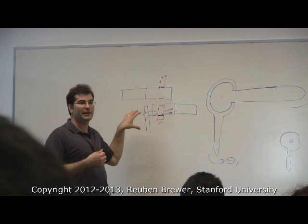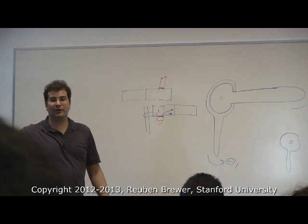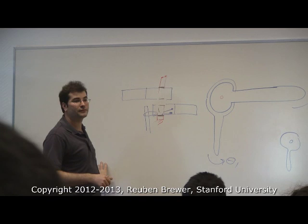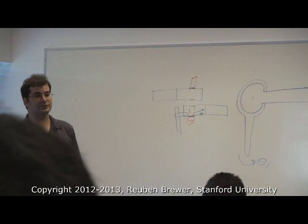So one of the most important things in mechanical design is how you're going to assemble it. Do I have to have part A connected for me to do something to part B? As much as possible, try to have everything on its own so that if I need to fix this one, I don't have to take this one off. You want to be able to fix this part of the robot without disassembling the whole thing. Are there any questions about what I've just said or anything else related specifically to ball bearings and their usage?